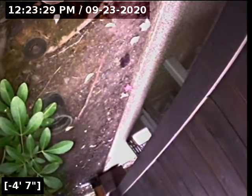Anyway, overall, the line is functioning at this time. It's draining slower than it should in a few different areas. You got two bellies, notably, on this portion of the line out near the septic tank. You know, from 90 to 97 feet and 139 to 144 feet, you've got bellies there with 2 to 3 inches of standing water in them.